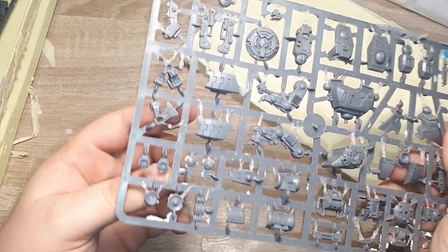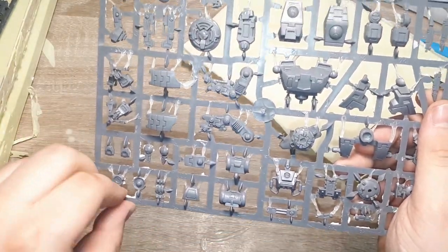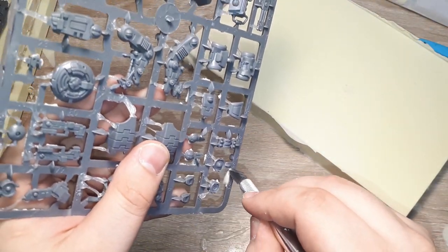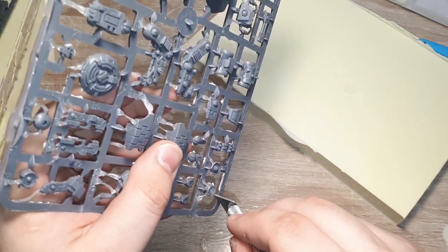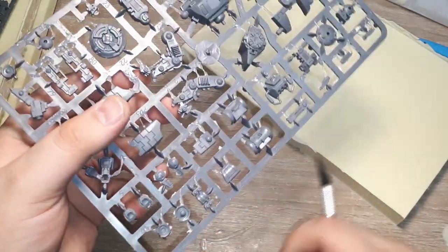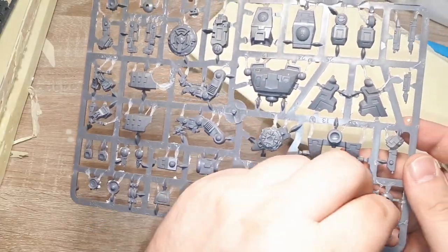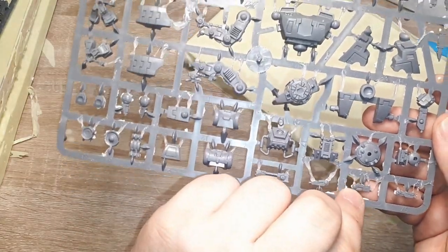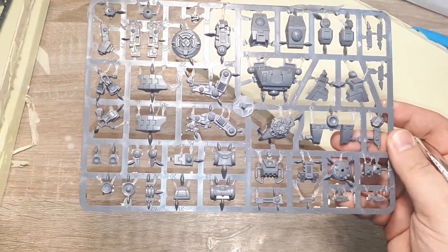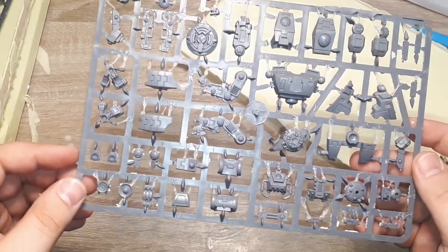After the second, maybe third time, it seems like whatever oily residues acted as mold release would wear off and the plastic would be open to the silicone to just freely bond to it. And as you can see, it does ruin, or at least impose a whole bunch of additional cleanup on, the original parts, you know, the good ones. So perhaps this is just not compatible with Smooth-On branded silicones.